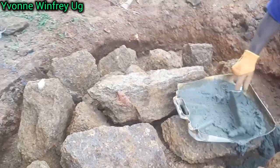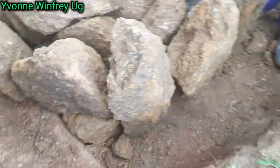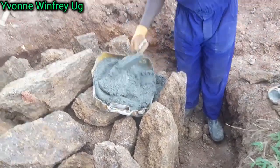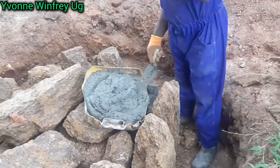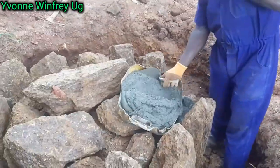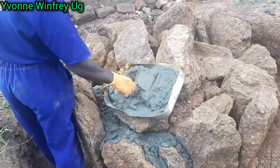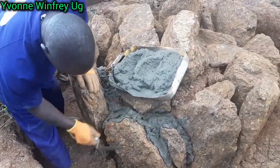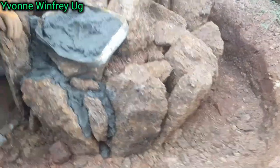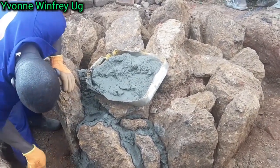And as we are filling in, we're going to be getting more of these rock stones, the smaller pieces, and still continue to add them, so that they also help in the filling, and connecting stone to stone, so that it is kept together into kind of one piece, connected together, so that the tank stand is formed, and the tank will be ready to sit on it, and it will keep the water. So I think you're seeing all these gaps. We have to connect everything together.